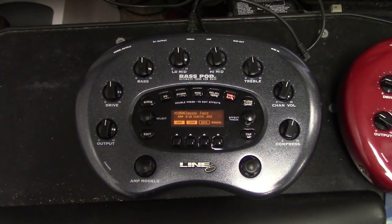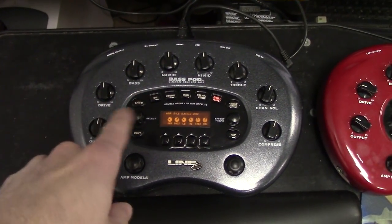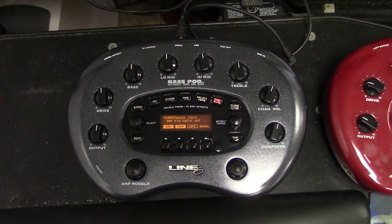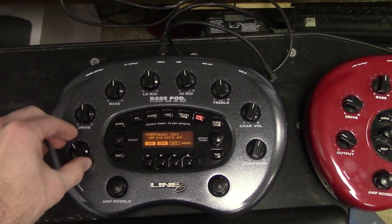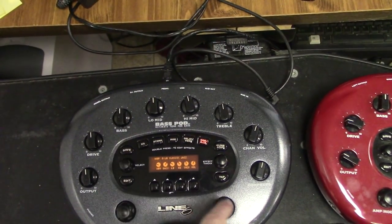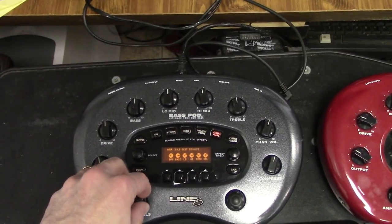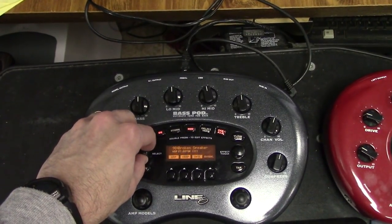And in this video, this is actually going to be a continuation of the last video I did where we addressed some issues with this BassPod XT that I have. So if you didn't catch the last video, go ahead and check it out. In that video, I replaced all of the rotary encoders, these four rotary encoders here, because they were having intermittent issues, but they all seem to be working very well now.